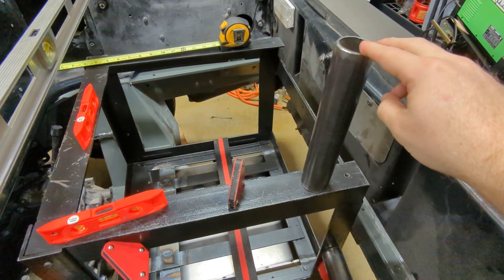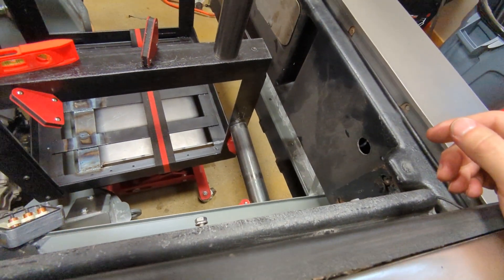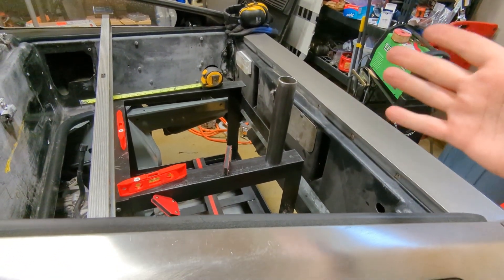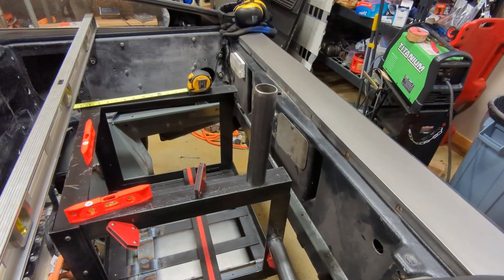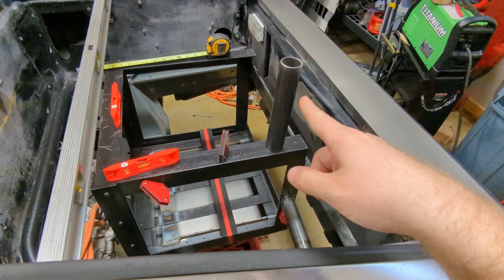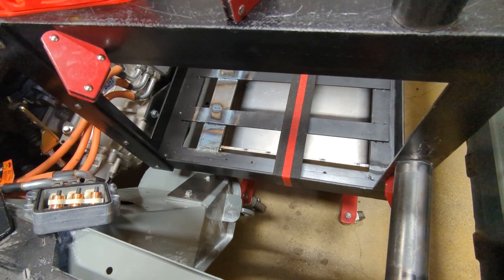I've cut two pieces of tubing, and you can see one is in place now held with magnets. I'm going to tack weld this one into place, then tack weld the other. It's taking a lot of time going back and forth — I have to cut the tube to roughly the correct dimensions, then use the bench grinder to grind away material, test fit it, grind and test again. It's been about 45 minutes to get one fitting well without a big gap. Once these two rear ones are in place, I'll move on to the front, which will be a bit shorter with a steeper angle.